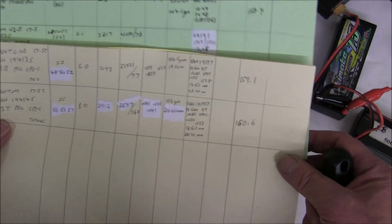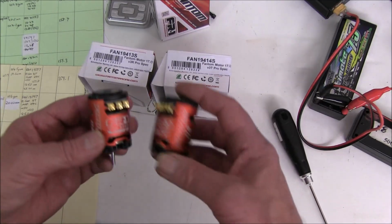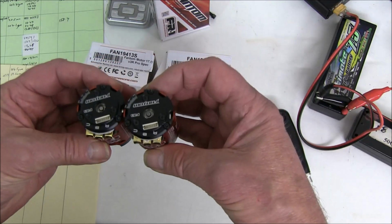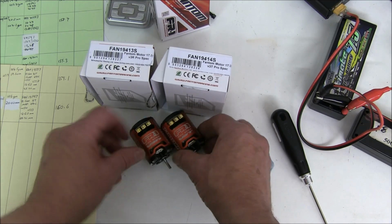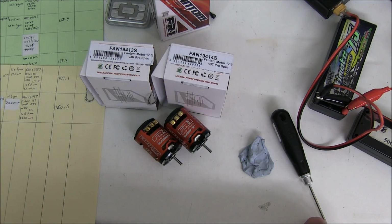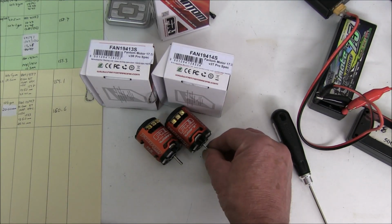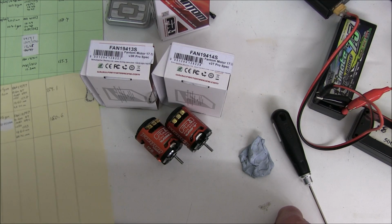Is this motor the new class leader? Well, is it a big step up on the version 2? Maybe a small amount. Manufacturers have got to sell their product, they've got to make big claims about them, but I would say it was a small step. And the cooling holes, yeah, that's good. Not as massive as some of the others like Much More and R1, but still good to keep them cool. The Kawasaki steel is obviously good, no fade. I can't say about the quality of the rotor, if it's a no fade rotor or not. It looks pretty much the same as all the other manufacturers now.